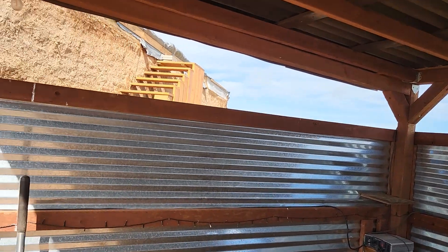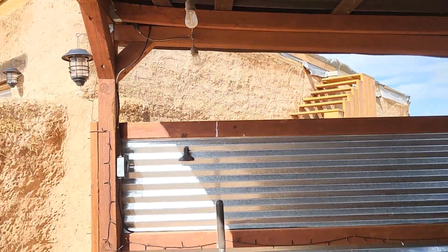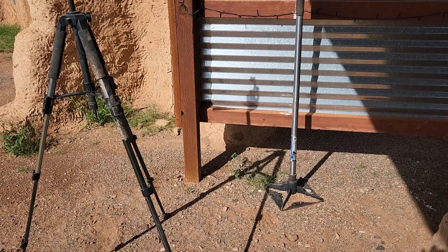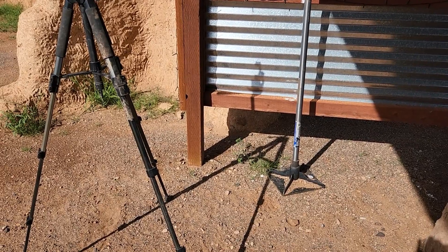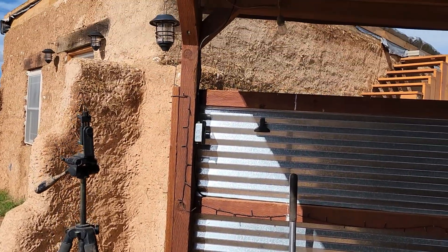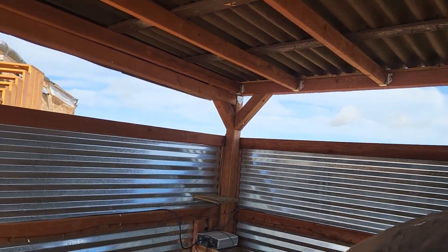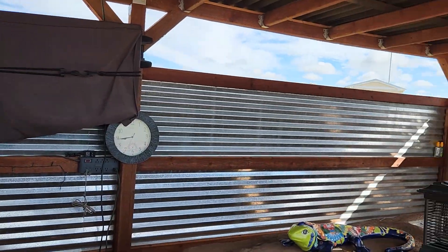This is a simple construction on our cover. Down in the ground those pieces of lumber are concreted in — it's 4x4 construction on all the heavy parts of the frame and 2x4 on everything else. I really like how that turned out and it's been pretty darn good.